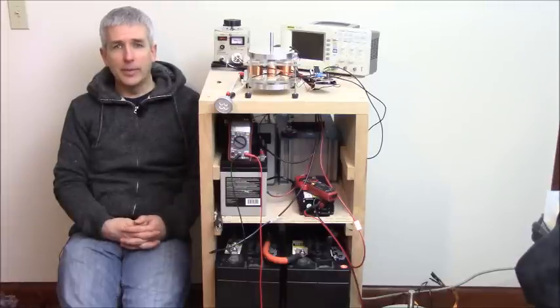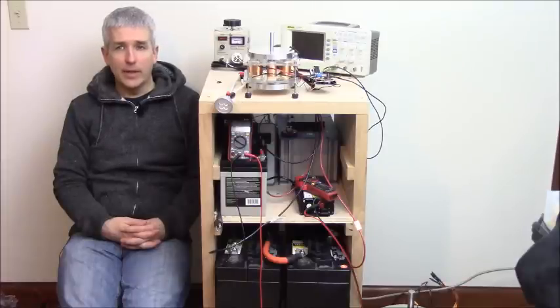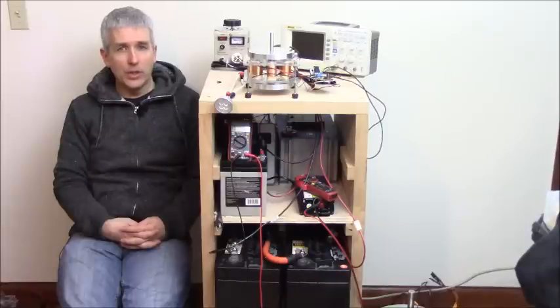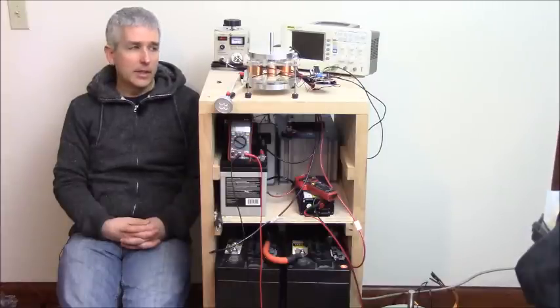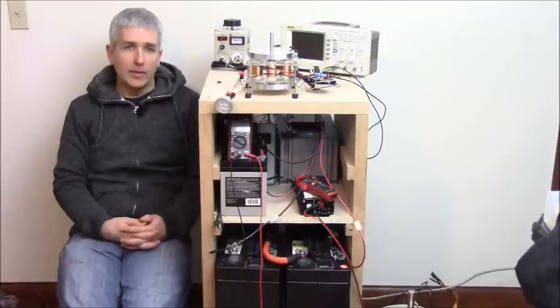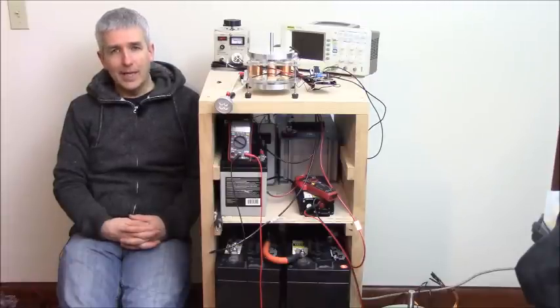And you see this is standard procedure that people have an external diode, and usually you want a lower voltage rating on that diode. Well, this is not a regular diode though, we're looking at a TVS diode, is what I should have said. So instead of using the slower switching lightning arrestor, we want actually the TVS diode. And those have a starting switch on period and a maximum clamping rating. And so you want the maximum rating of that diode to be lower than the maximum rating of the MOSFET. But all this dampens the negative energy pulse.